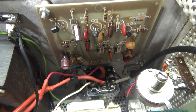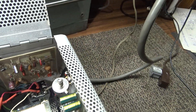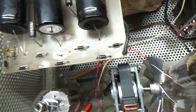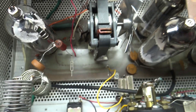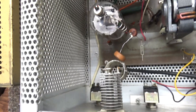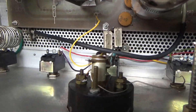There's a lot of misinformation on these amps — we reverse engineered it and it's just basically a grounded grid amplifier. The high voltage power supply board is over here, and the low voltage power supply is here. The bias is about 12 volts negative, and over there is the keying circuit and preamp board, even though the preamp is disconnected. You've got your four final tubes, tuning load cap, coil, fan in the middle, and one driver tube. That 'drive' on the front is a tuner — you always tune it for max output. Don't tune it down or you'll kill that one driver tube pretty quick.